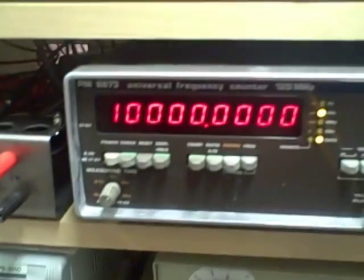About the only thing I'm using the five volts for currently is to power my LED. I do have the LED circuit and the on-off switch. Here's the output of the board — this is my master oscillator. It's an MTI unit, a five megahertz oscillator. It's actually a double oven — very consistent and stable. I was able to tap into a voltage line and with a potentiometer I could change the voltage on the VCO terminal and give myself a fine tuning adjustment. This little steel-cased unit right down here is my times-two multiplier, so I'm taking the five megahertz, multiplying it by two and giving myself ten.